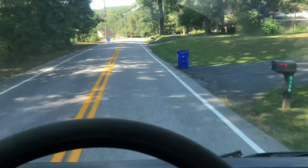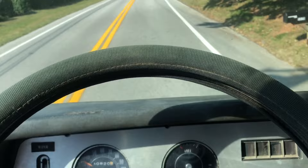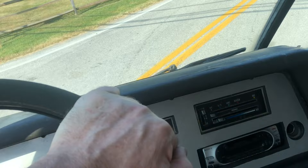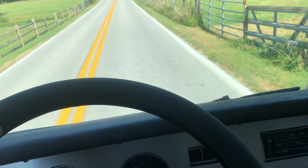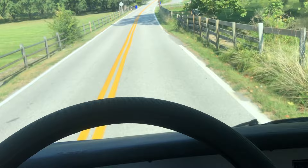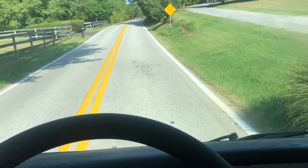The bane of my existence now is this fuel gauge, which reads totally empty. I've got new sending units, and I directly hardwired and bypassed the switch for the fuel sending wire coming off the main tank. I took it to the gas station and added 17 gallons of gas — it filled up to the tank, so we know we're full. Now I've got to mess with that fuel gauge a little more to sort that out. But it's just driving great.